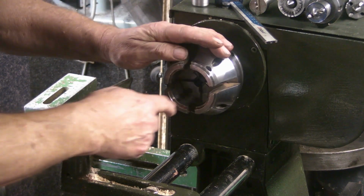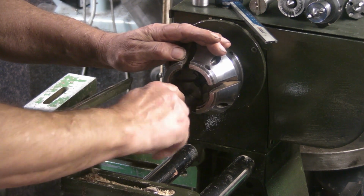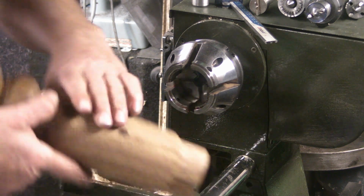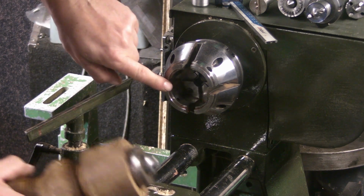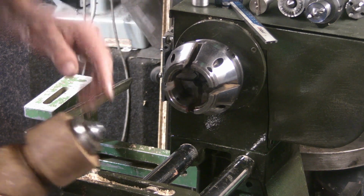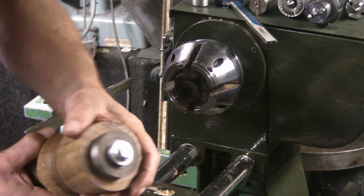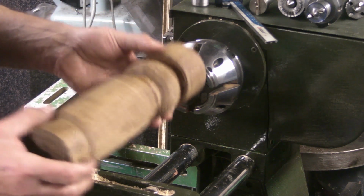But there's also a chamfered part on the inside for gripping a backplate. So that's what I've been making on the lathe. The optimum dimension is 50mm on this. So I've turned this plate down, put a coach bolt through that locks onto the wood, and then we've got this as 50mm.